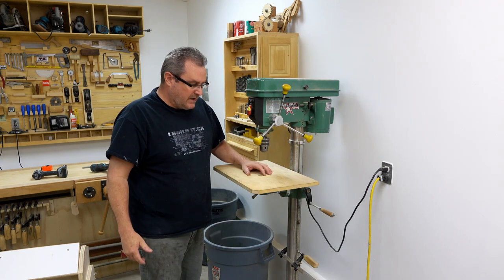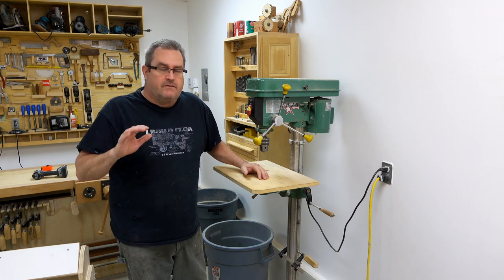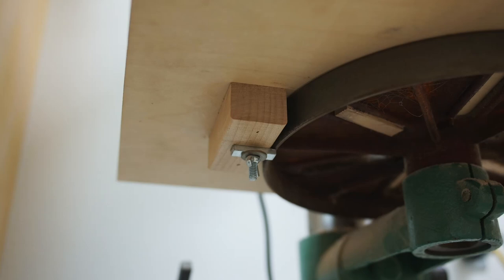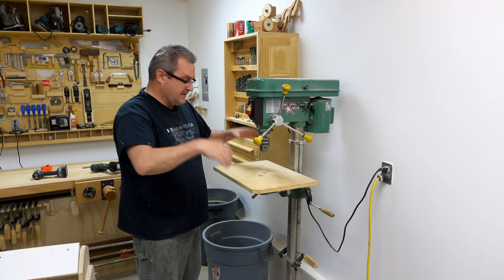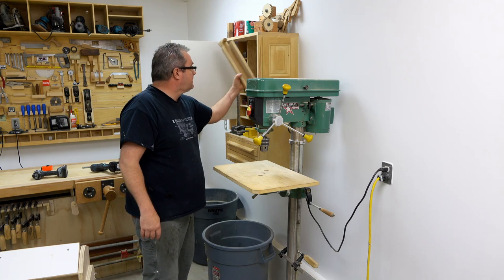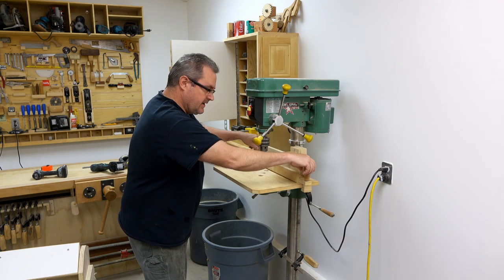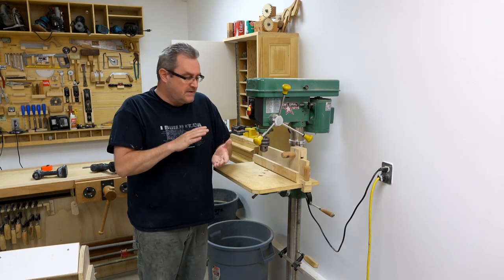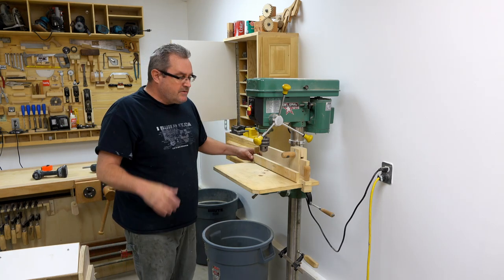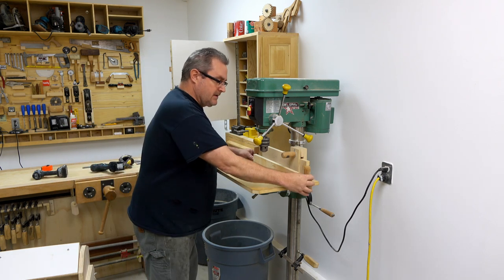I made this back in 2012 and I've been using it ever since. There's nothing wrong with the design — it's what I believe to be the best solution for a drill press table. It's simple, it's not very big, it doesn't have to be. It's thin and light, easy to remove — it's got two wing nuts on the bottom that you can unscrew and take it completely off so you can use the metal table underneath for drilling metal. It also has a fence system I keep inside my cabinet, and that's simple too. It doesn't have any T-tracks — that's one of the key features. I made a drill press table long ago with T-tracks and I was always cleaning them out; they'd fill up with shavings and dust all the time, just a totally annoying thing.